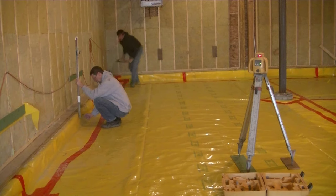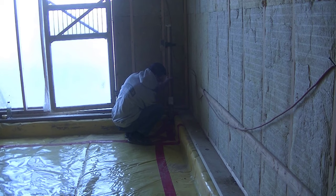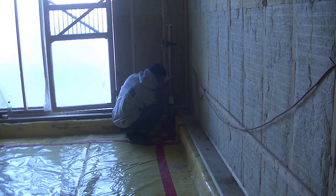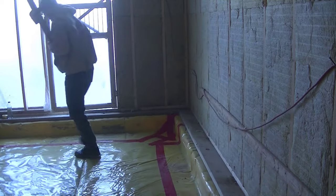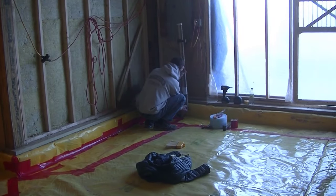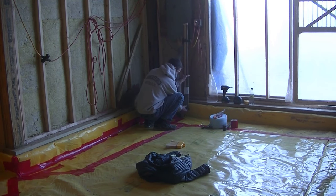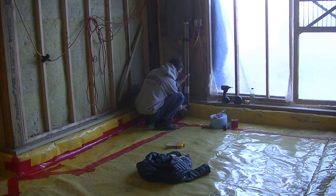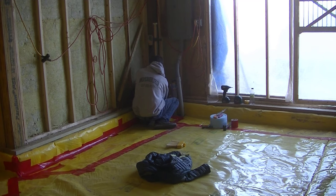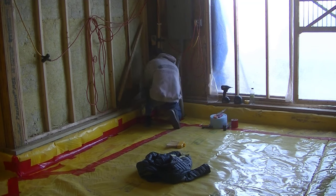You'll see that in a second here, and that'll tell me just how thick the floor is going to be. We were shooting for a four-inch thick concrete floor in here, so we'll see just in a minute what that's going to be. That depends on how good the excavator or whoever did the sub-base grading did their job, and that's how I figure my yardage for my concrete.